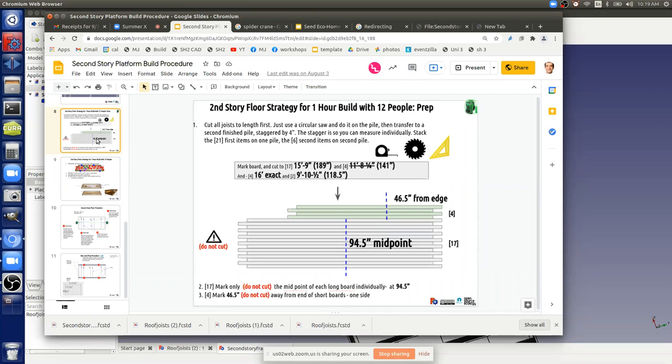I think that worked. It was a little bit of extra work here, but when we laid out the plywood, it was, okay, bam, right there. No messing around, like, where is it going to be? I think that's useful still, so I would suggest it. Somebody's trimming every single one of these. These are all oversized for 16 inches, so everybody's trimming them, and you can mark it right there. The trimmers are markers. And mark both sides. So joist cut and mark.